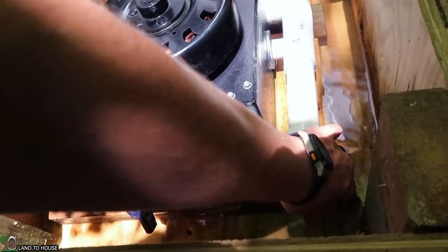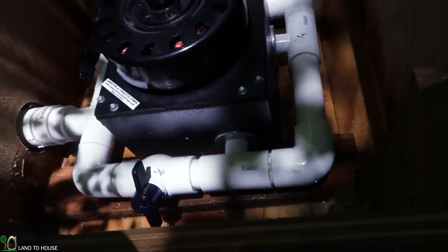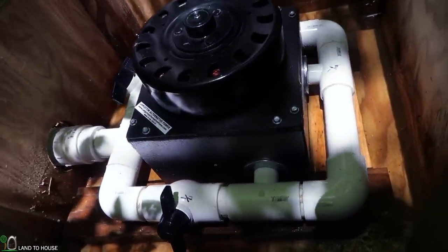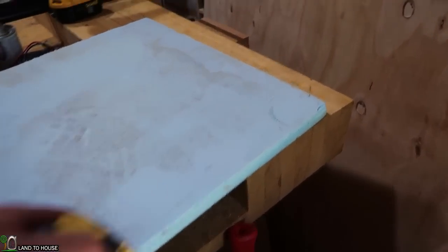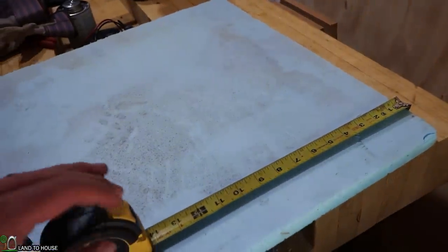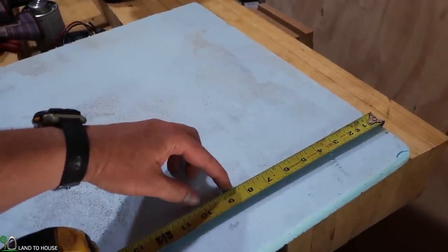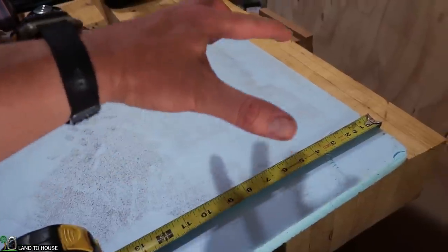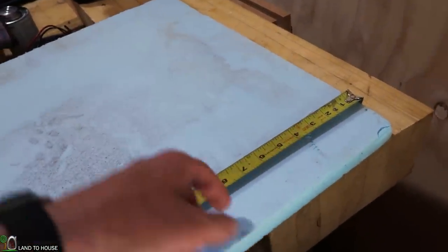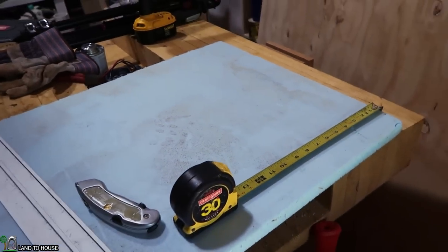I'll have to see what I can do about the drain. Let's go ahead and get some of that blue foam, cut a hole out of it, and get it sized in here so I can just set the turbine down on it and maybe it will prevent the housing from filling up. The turbine's metal housing is exactly 9 inches, so if I cut to about 8¼ inches that will give me enough room to set it down and make a little indentation to keep the water directed straight down. A couple of days have passed and I found another issue to work through.